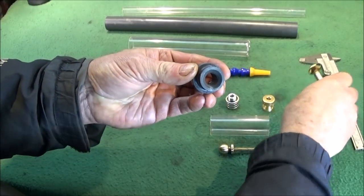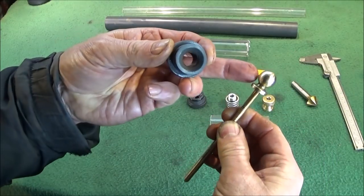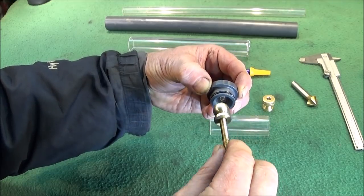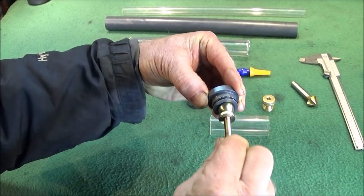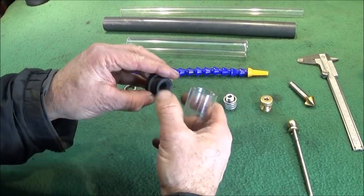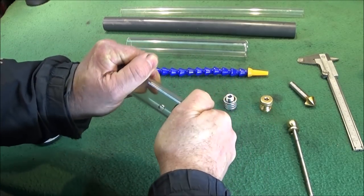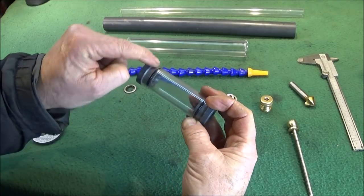On the bottom end I've got a cone which I made quickly using a 45 degree chamfer tool. The brass ball end came off the front of a fireplace — I put that on some threaded studding, then put it in the lathe and used the brass ball to lap it against that cone, just lapping those two together. That's the underside one that fits in there. The top one doesn't need a cone — just have it flat and push it in the top. You can see it's a nice fit and the rubber hasn't sheared off at all.